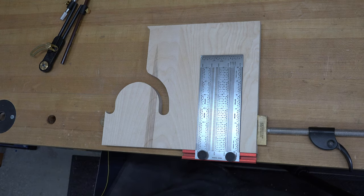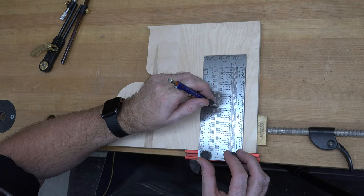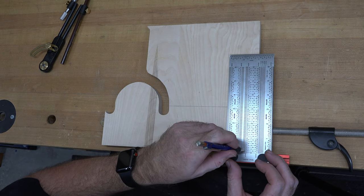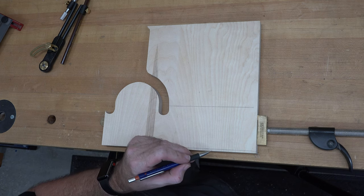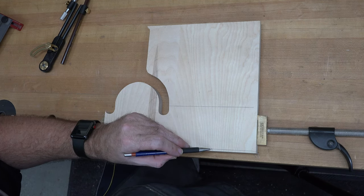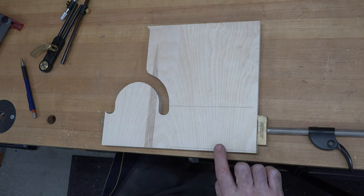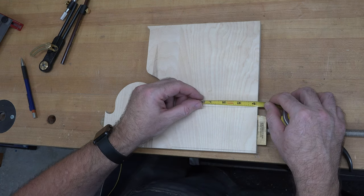It also starts off with the design of the tabletop. I have a piece of three-quarter inch thick ply and this will be our tabletop. I need to mark the center of the circle, and that's going to be at three and an eighth inches. This is going to be a six inch tabletop, and the reason the center is at three and an eighth is because I want to leave an eighth of an inch at the end for cutting. So if I mark the center at three and an eighth and mark another line at one eighth of an inch up, all I have to do is align my compass point and pencil with that mark, and that will yield a six inch circle.